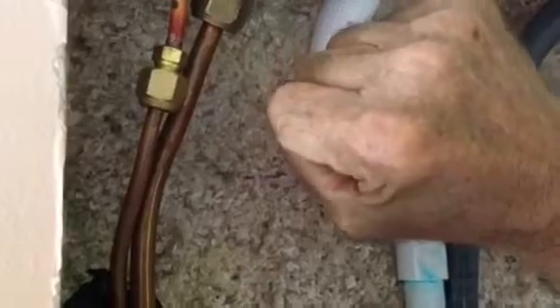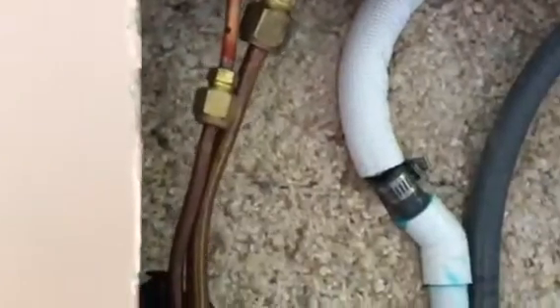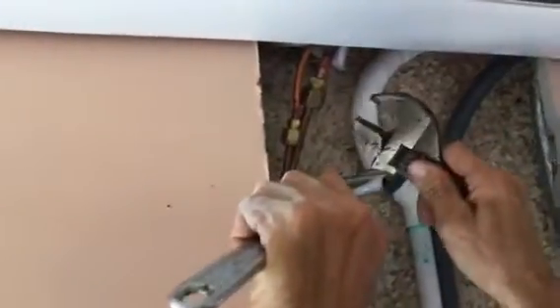Right here is the problem. When the guys put this together, they didn't have the copper lined up exactly perfect, or they didn't torque it down. What one needs to do is take a couple of crescent wrenches and fix it that way — I'm not going to do that on this video. On top of that, we'll do a bubble test using what we call soap in our industry, put it around the connection and make sure it's okay.